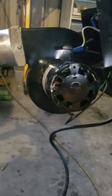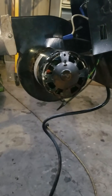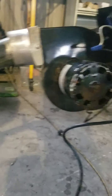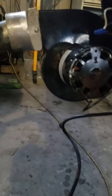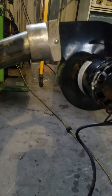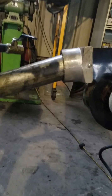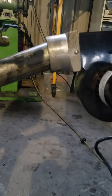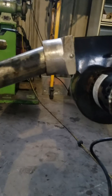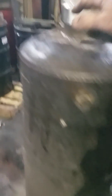There's my turbo fan. Now this fan right here can actually be installed outside, and then you run some two-inch PVC from outside into this boiler and tie it down right here. Now what are you doing? You're actually bringing in outside air for combustion instead of drawing air into the shop and then out the stack. You're not losing any heated air at all if you bring in outside air, because it basically just goes up the chimney.